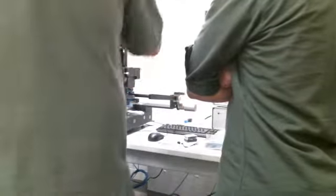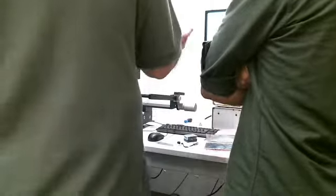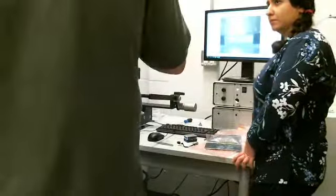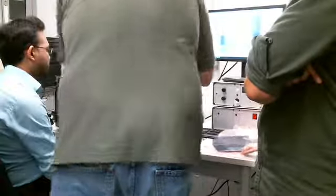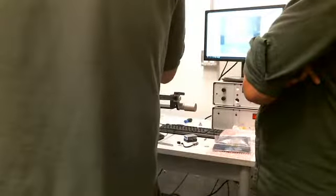Before you do anything, typically, if you're going to be bonding something, this is how it would be. You hit the play button, then your heat and all your stuff would go. But this is our calibration, so we have to see how it plays. When we calibrate the beam splitter and line it up, I like to say that's perception. Then once I place it down and we look at the results, that's reality. If our perception and reality aren't the same, then we make adjustments to our beam splitter so that they're calibrated together.